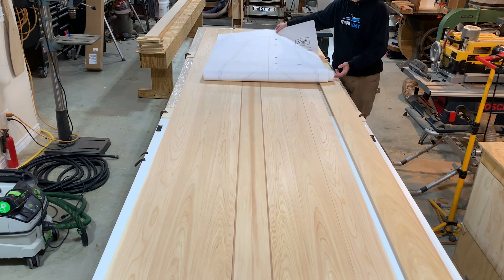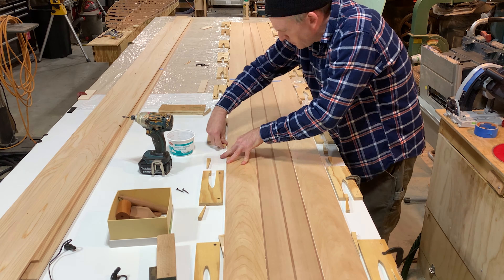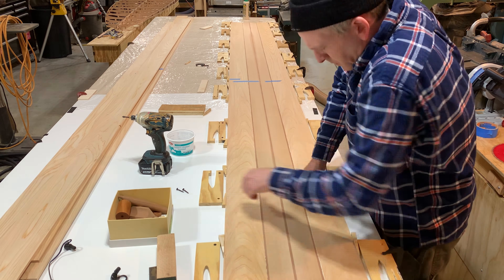As you can see, it's oversized, so once I figured out my layout, I ripped them to width — maybe five-eighths or three-quarters off of most of them — to get down to the right widths so I'd have just a little bit of extra on the sides of the board when done. Then I did the exact same clamping approach to glue all these up: I screwed scrap plywood to the bench and just used wedges to hold it together. No clamps, no silliness with too many clamps. And then you just want to make sure it's flat, because you don't want to plane off a whole bunch of wood later.